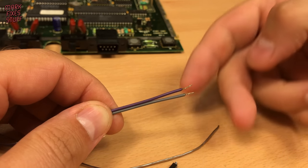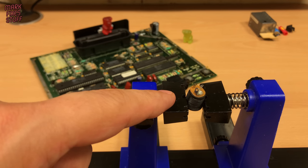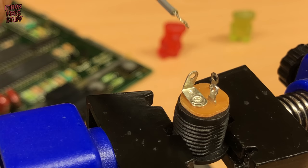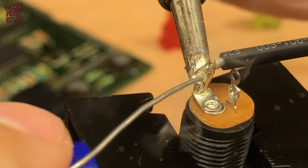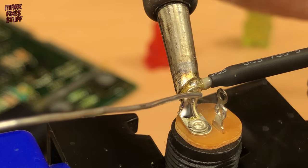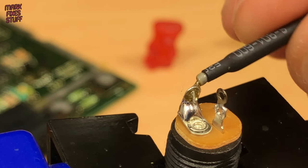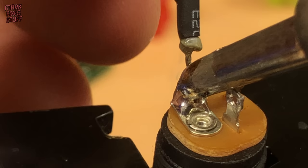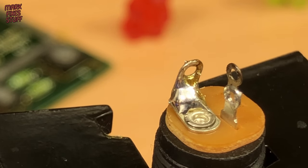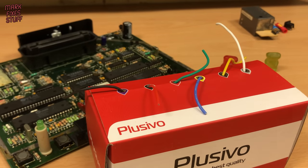I'm sliding some heat shrink tubing down over the wire and inserting the wires ready to be attached to the solder tabs. Except the solder won't take to the tinned wire — it just runs off. One last attempt and all the overheating has melted the shrink tubing. So here's the lesson: some wire is cheap and nasty, and some wires are not meant to be soldered, just crimped. This wire is the latter. Let's use some proper wire now and stop being lazy.